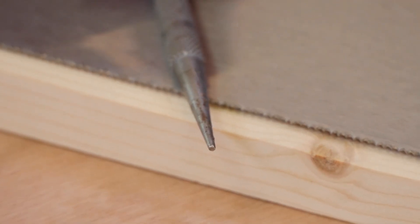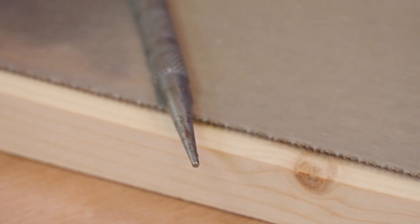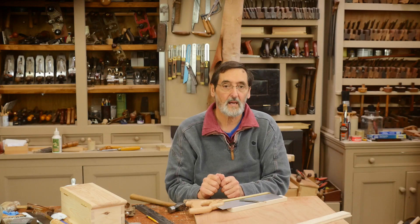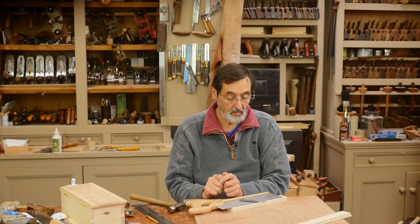This is a little bit different — I like the idea of this one. It has a little dimple in the end that I can put on the corner of a tooth and I can locate it with that. It makes it central to the tooth, and when I tap it with the hammer I get the exact set without any slippage. That's one of the nice things about having a dimpled nail punch.